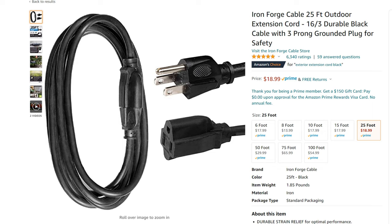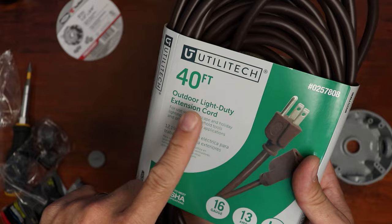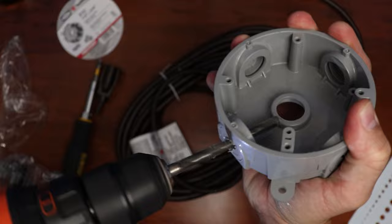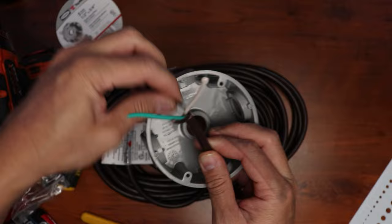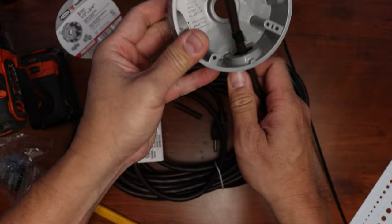When you open up the plastic junction box, you will have threaded covers which you need to screw into the holes. Get your extension cord — make sure it is for outdoor use; light duty rating should be fine. With a wire cutter, cut the cable to your desired length. Drill a hole in one of the covers as close to the diameter of the cable as possible, clean it out, and fit the cable through — the tighter the fit, the better for weather sealing. To prevent the cable from being pulled out, wrap a zip tie around the cable about 4 to 6 inches from the end, tighten it, and cut the excess.